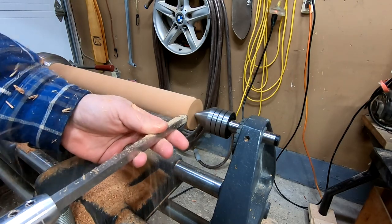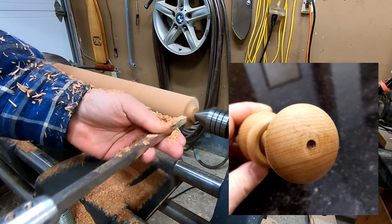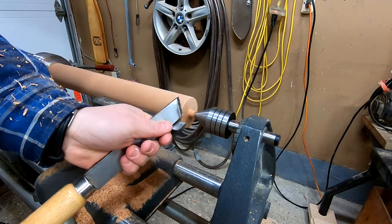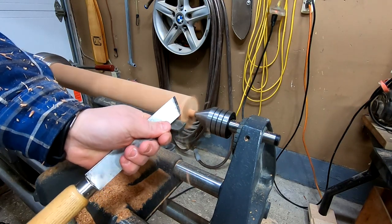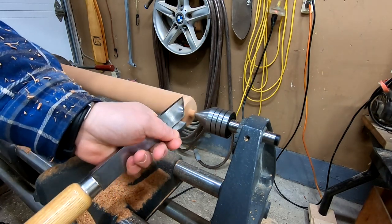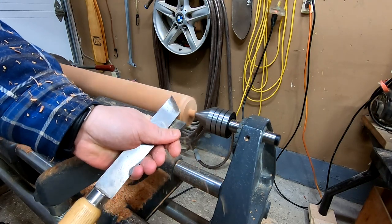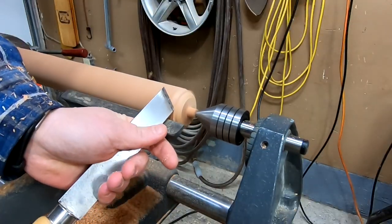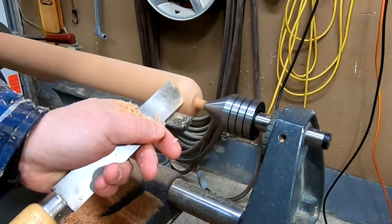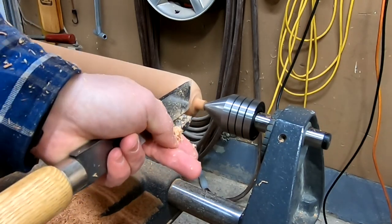Before I do any shaping, I remove some of the material at the end. If you don't do this, you'll end up with a small hole at the top of your rattle. I'm using my skew chisel to round over the end. I started making these rattles as practice for using my skew chisel, as they involve beading, V-cuts, tapers, and you can even practice coves in the areas you'll eventually remove. Using the skew can be a bit daunting, but I found if you just take small bits at a time, it's much more manageable. In the description, I will link to a video I found helpful in learning how to use my skew.